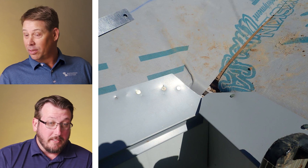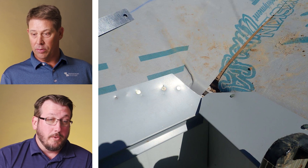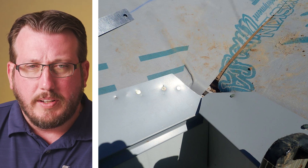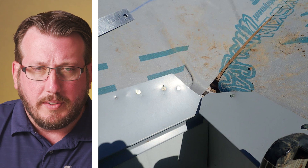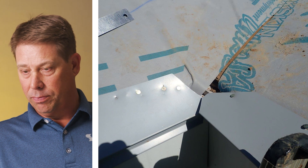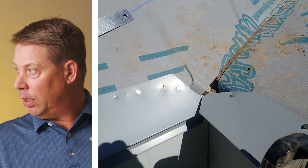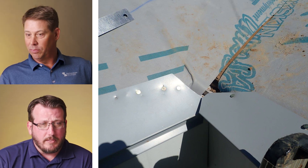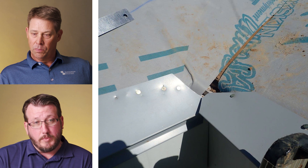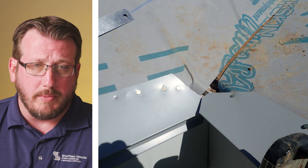I like the nails — that's a nice touch, but no. That's a very exposed valley. They're looking for a water feature on the inside. The worst part is it looks like it used to be one piece. The part most alarming to me is there's a chalk line at the top of the picture — like they planned on putting the valley in and then proceeded anyway. That's a lot of red flags all in one photo. The valley not being dried in, when that's going to be the main catch of water on your roof, is a major problem.